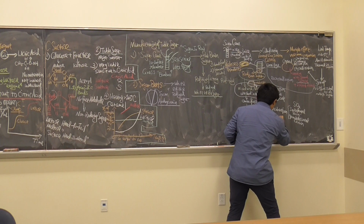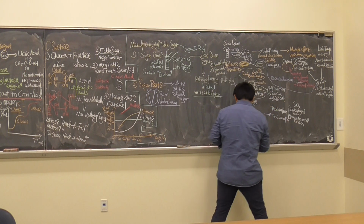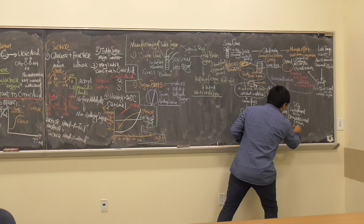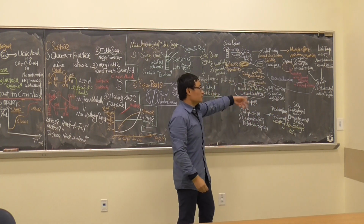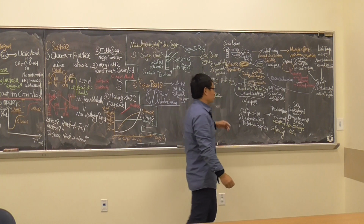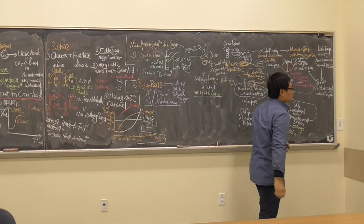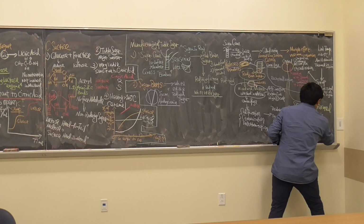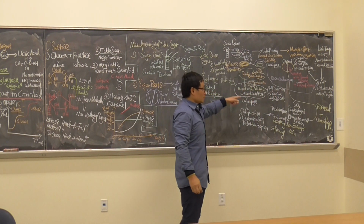And we need to do demineralization. There are minerals there, we don't like them, so what do we do? For demineralization we use desalting ion exchange resin. Then after this, we sometimes do softening. With all these three done, we pretty much go back to crystallization, or recrystallization, followed by centrifuge. We pretty much will get a white refined edible sugar.